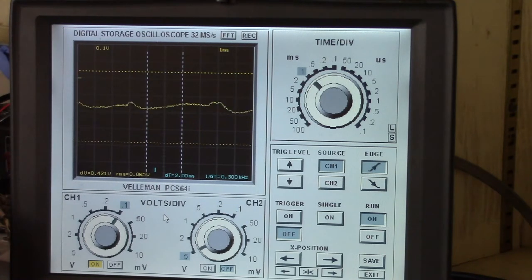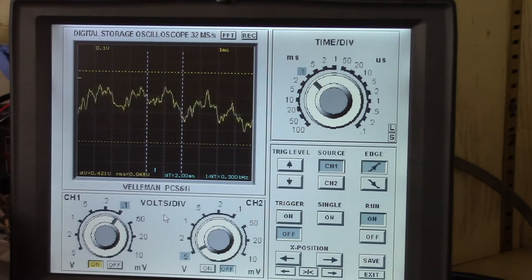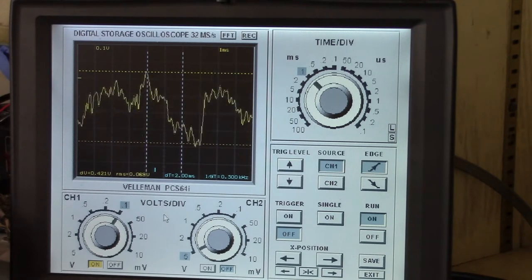So these little headsets were really quite an impressive achievement in their day, considering all they basically are is a coil of super fine wire going across an air gap that's pulling on a very thin piece of steel sheet metal. And then there's a permanent magnet that's kind of biasing the field strength, so that you're either building or reducing the field strength, mostly from the permanent magnets and not from the coil itself. The coil appears to be contributing very little power.